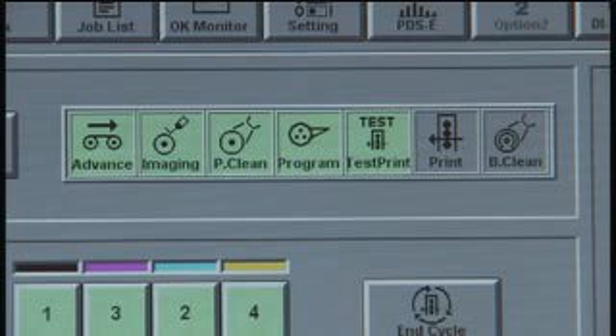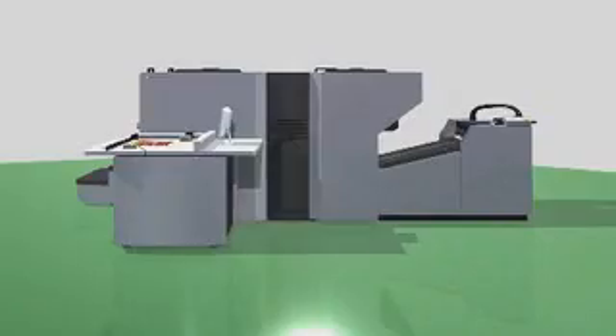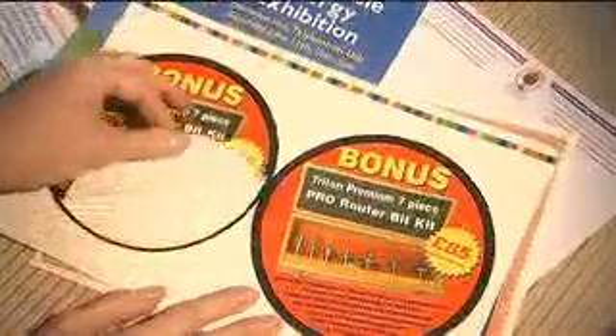The press automatically runs the specified number of test sheets. Inside the press, Prestek's unique zero-transfer printing process, or ZTP, lays all four colors down on the sheet without any transfer between grippers, whereas a conventional press requires tower-to-tower sheet transfer, which challenges registration and restricts substrate choices. Eliminating sheet transfer delivers first-sheet registration and results in an unsurpassed level of sheet-to-sheet and job-to-job consistency. In addition, it expands the available range of printing media, including onion skin, 20-point stock, and synthetics like styrene.